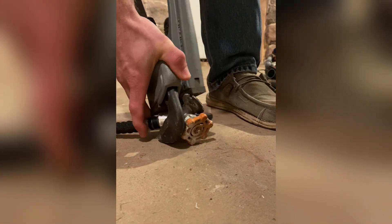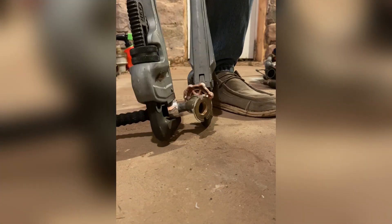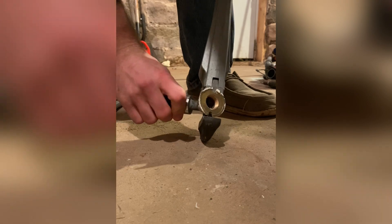Since I took this video, I recently learned that putting a flame to the hose bib itself where it's screwed on can actually help loosen it, making it a lot easier to remove. I wish I knew that before I started. I've run into this problem quite a few times — only once was I able to remove one without having to replace the hose bib.